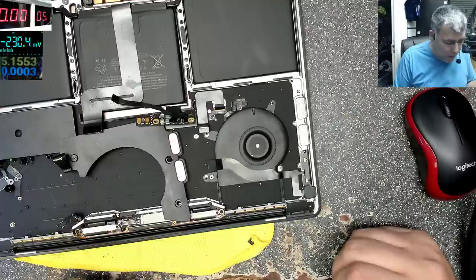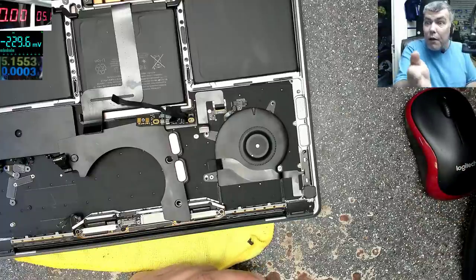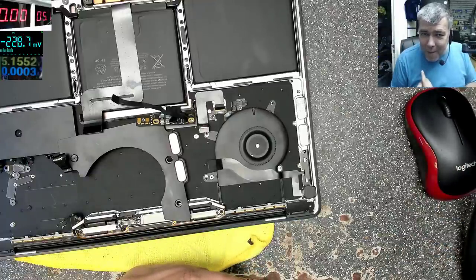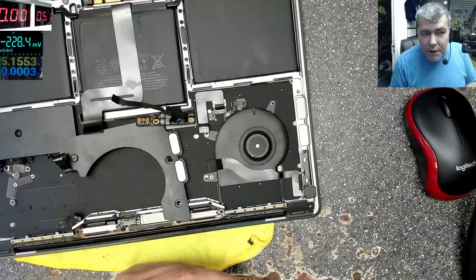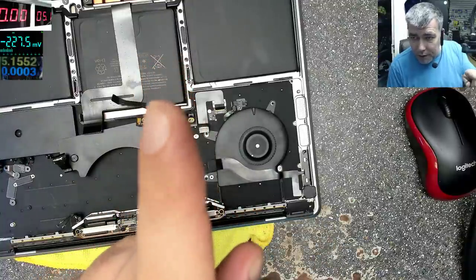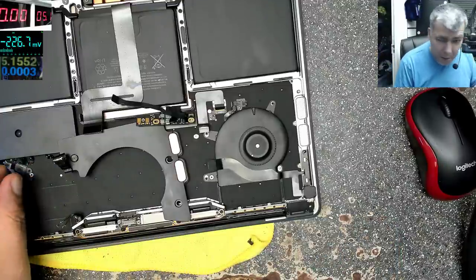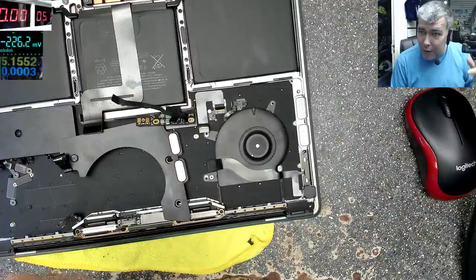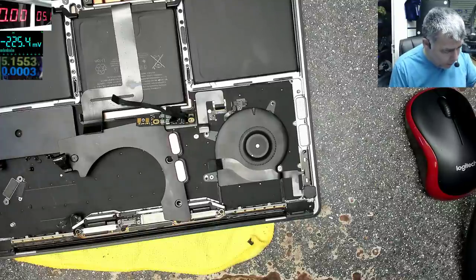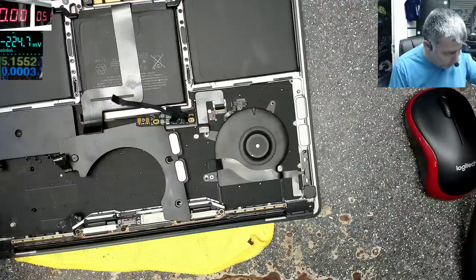You are the manufacturer. What do you think first? My capacitor will go shorted. And you know the funny part? The funny part is there is no switching on that power rail where the capacitor dies. Maybe switching before the diode, but not right there. That's why I don't understand how this capacitor can die like that.